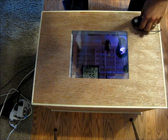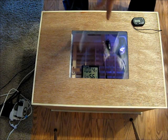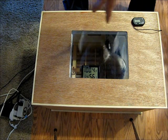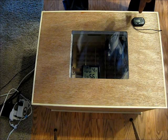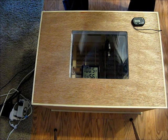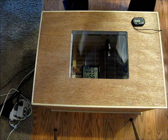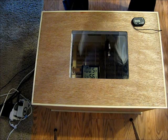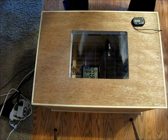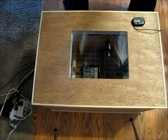This little thermometer is a lot more sensitive than the big LED screen you see in there. I moved the thermostat closer and closer until I got it within a range I liked — it varies between 98.7 and 103 degrees, kicking on at 98.7 and kicking off at 103 or so. The other thermometer takes a little longer to change, so it hovers around 99.5 to 100.5, which is perfect for chicken eggs.